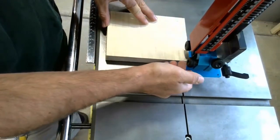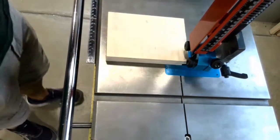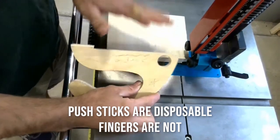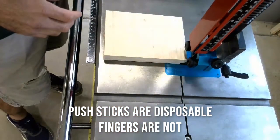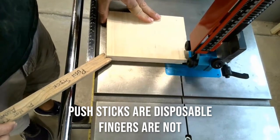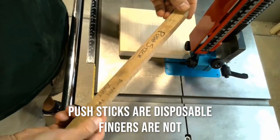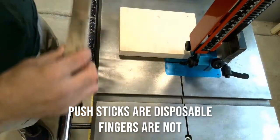That could mean, if you're cutting close to the edge of your piece, that you just have one hand on the workpiece guiding it through. The other option is to utilize a push stick — this style can go up against your piece, and you can cut right up to the edge; it's not a big deal if this gets cut by the blade. The other style of push stick goes on the back corner of your piece, and as you push it through towards the blade, it's not a big deal — this push stick has been cut up quite a bit, but it's a disposable piece of material. Much better for this to get cut than for your hands to get cut.